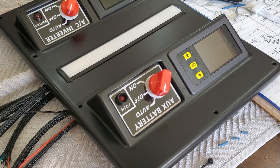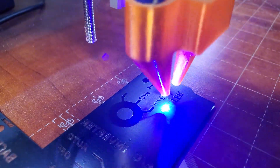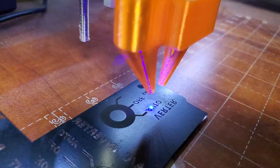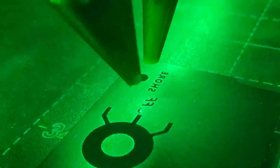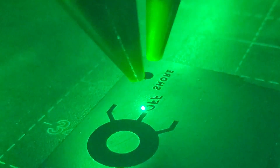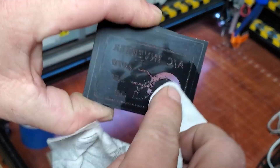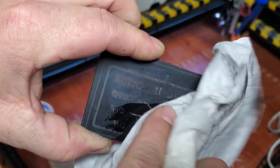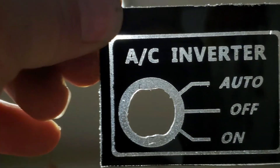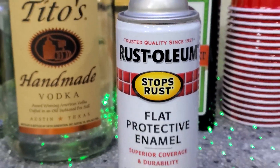The display panel is made by painting one side of an acrylic sheet flat black. After the paint cures, design data is sent to the homemade laser machine and the pattern is etched in. After engraving, the technician lightly wipes the design with denatured alcohol, which removes the engraved area. The final step is to paint the back side white, which will diffuse the LED backlighting strips.